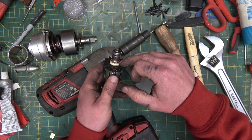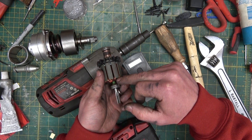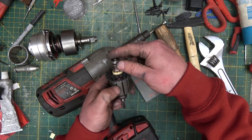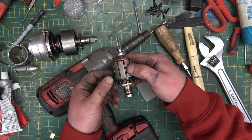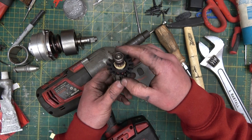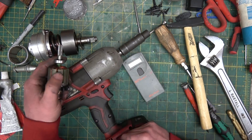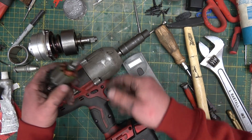You can see it got real hot there. That epoxy — what holds the windings to the commutator bar — got hot. That's mind-blowing that it would weaken over time, getting higher and higher resistance. I never would have guessed that was the failure mode of this one. And very likely most of them — the armature getting weak.